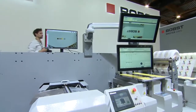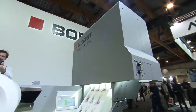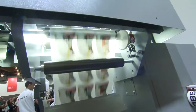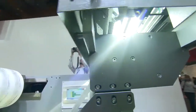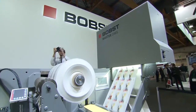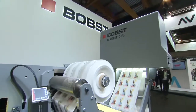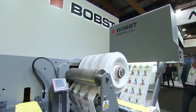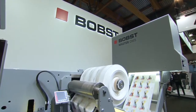Before we close, there's one more innovation I'd like to highlight: the big gray box at the end of the machine is the Bobst IQ 500, a high-end inspection system specifically developed for inspecting multi-process jobs. It inspects the substrate, the printing, the special effects, the tactile effects — everything — and detects even the smallest defects for total control. With the Master DM5, each and every process is digitally controlled: this is Bobst digital automation.